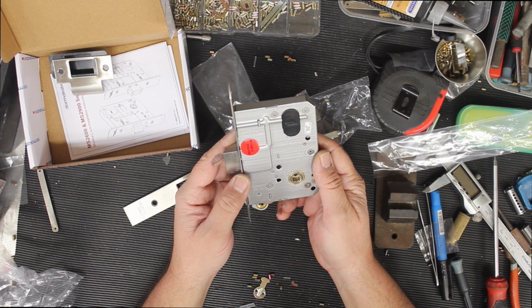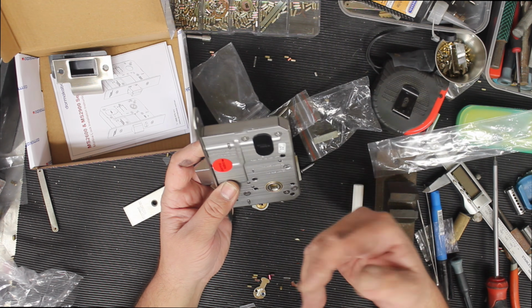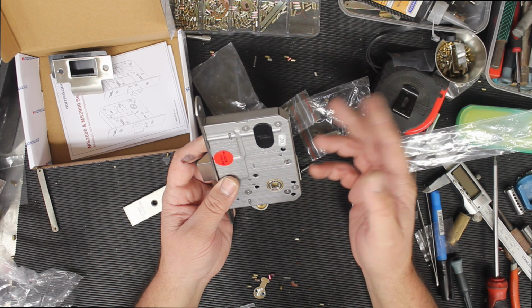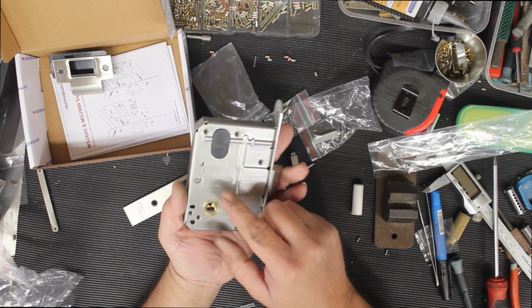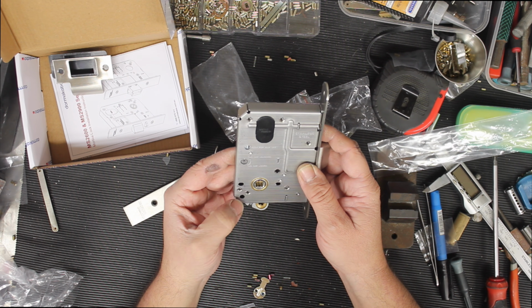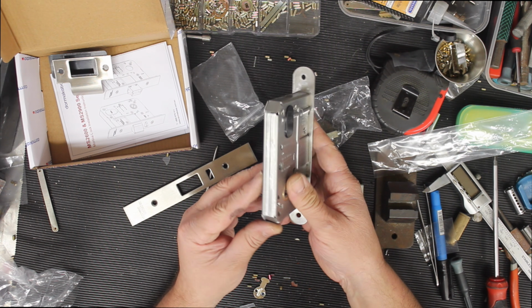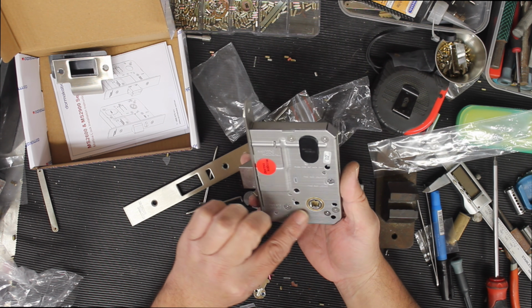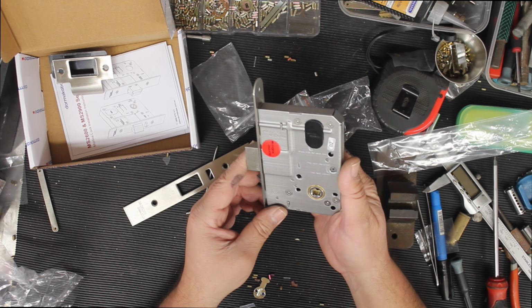So that's why it's so good, because it's configurable in all different ways. Internal locked, internal, external unlocked, kick-off, anti-panic, all these sorts of things that you can do with it. And it's as simple as just configuring this part here and this part here. Looking at the body of the case, yes, it is made from stainless steel. It does have a fire rating as well. It's starting to look a little bit cheap and nasty in the manufacturing, like it used to be a little bit more refined on the finish. But on saying that, these guys are big guys. I think they know what they're doing.